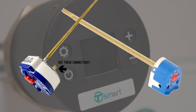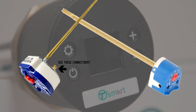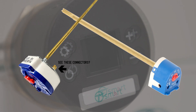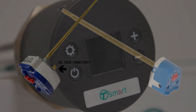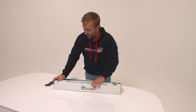To reiterate — for a retrofit installation to work, you will need to make sure that your current immersion heater has the special tongs, just like this one here, and a plug-in rod thermostat. If it has the type of thermostat that you see on the right hand side without the electrical tongs connecting to the immersion heater, you'll have to change the whole immersion heater over. So why don't we very quickly install this one on the vented cylinder that we've got through here.